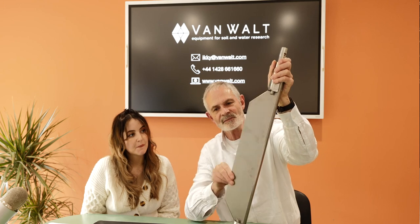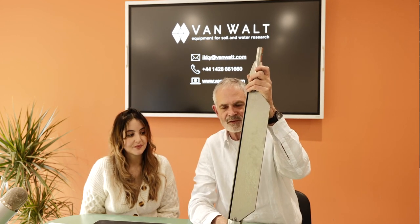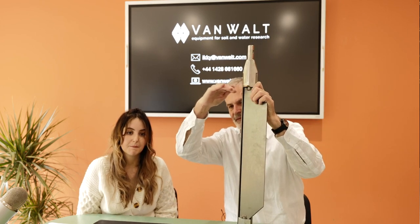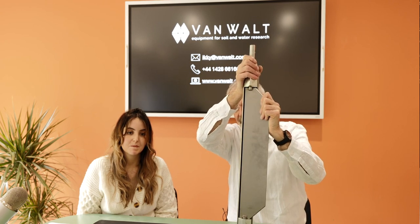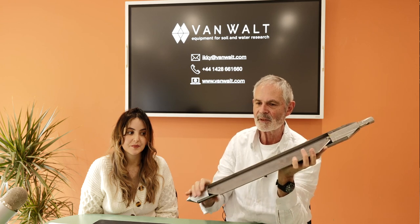For those of you who haven't used it, it's a relatively straightforward tool. The fin is what provides resistance. Let's say you're interested in the horizon from 3.5 to 4 metres — you can insert this in a closed position right down until you get to 3.50 metres. At that stage, really all you need to do is twist the sampler around its axis, and now it's captured the sample within the chamber. The chamber length is 50 centimetres and the diameter is 50 millimetres. So you get a really nice undisturbed sample. It's also great for very loose sediments and muds.